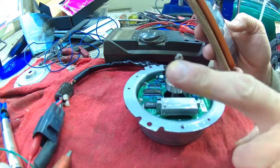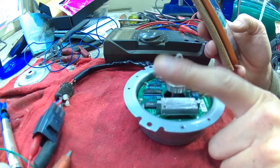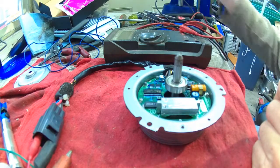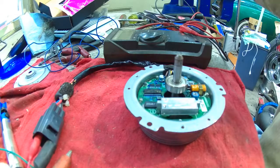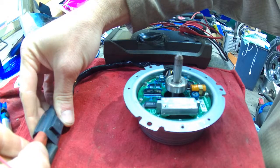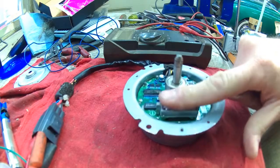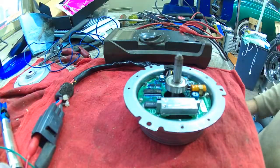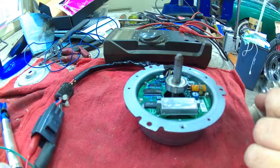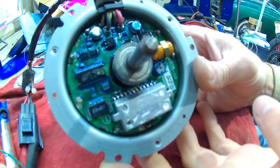The first thing I noticed when I applied 12 volts to the red and black ground is that this heat sink component started getting nice and warm. I can look in there and see that one of those legs has turned up a darker straw color, so it is probably fried. Let's see what happens when I apply 12 volts and then trigger that - nothing. Yep, that's getting warm. It looks like that guy - yeah, there's a little bit of stink coming off of it, so it looks like mine is already smoked.